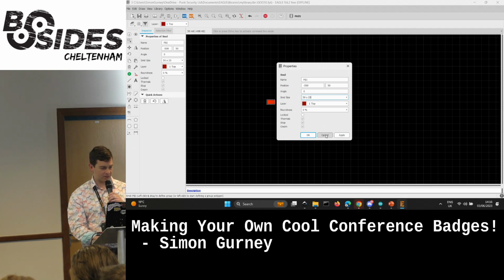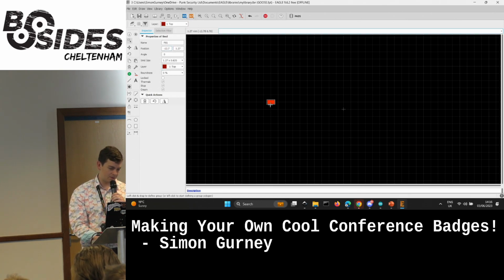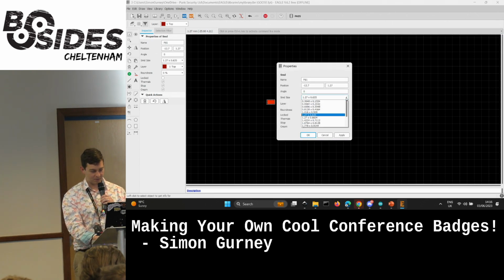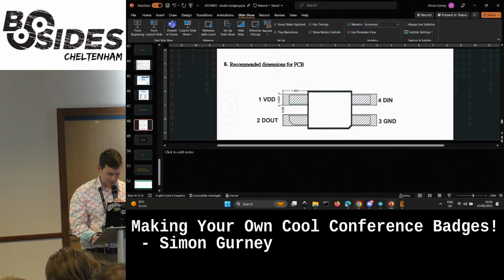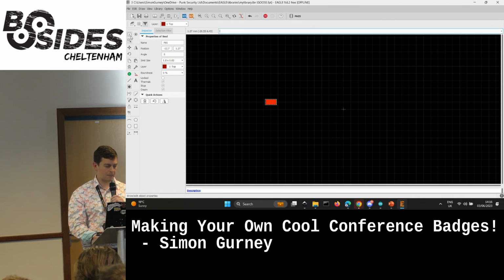Those dimensions I don't recognise. Let me change this to millimeters. Mils is some crazy thing that engineers use. You don't need to worry about that, I don't think. I haven't so far. Right, there we go. Millimeters now. That's a bit more sensible, isn't it? So they wanted 0.82 by 1.8. Boom. So that's our pad.